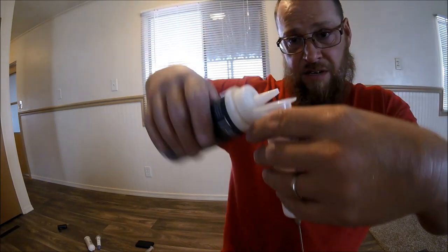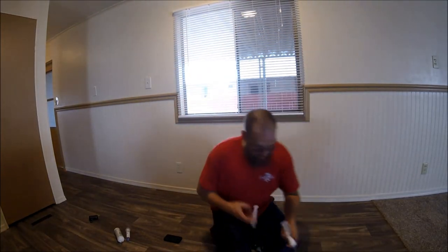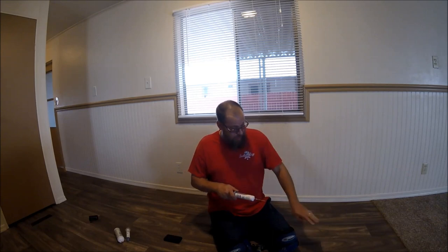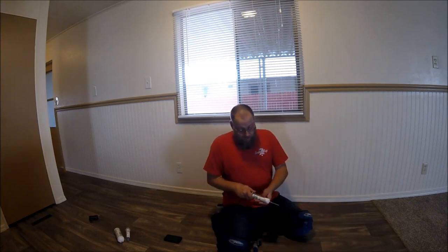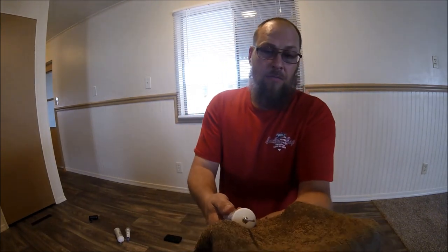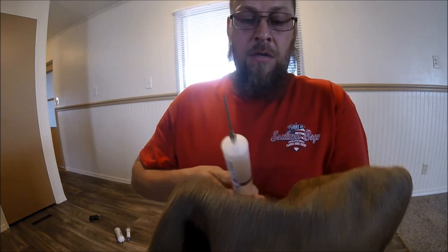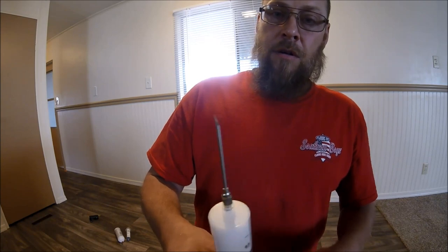I just want to put some sealer in the syringe — you're not going to go crazy with it. Just like any other syringe, you don't want a bunch of air in it when you go to push it underneath there, because you're just going to push air under the vinyl and make the bubble harder to go down. So tip it upside down just like you would any syringe. You'll probably want to have a rag handy because it's probably going to come out just a little bit. Push up on the syringe to push the air out, until glue starts coming out the top — that lets you know you're good to go.